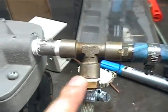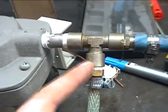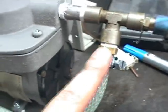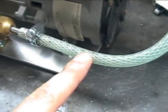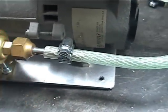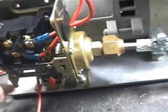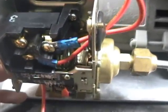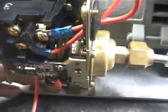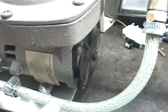We can see here we have a T-piece on quarter inch BSP fittings. A piece of hose brings us down to the vacuum switch here, so that the bellows inside — there's a little bellows in there — can sample the vacuum that the pump is developing.